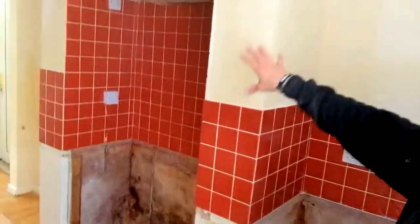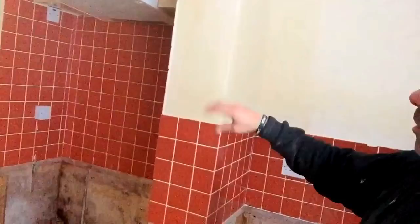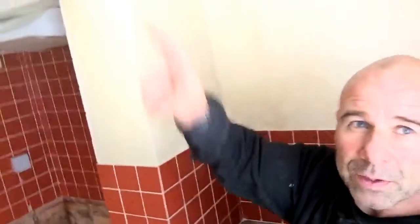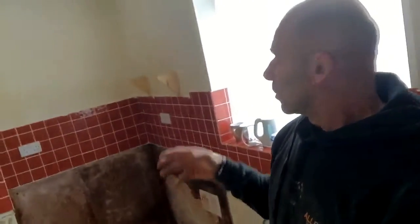Other thing that's going on — a damp issue, a bit of black mould. And then you've got a chimney pier with salt damp. Used to be a chimney. When the inside of the chimney gets wet, the sulfates eventually migrate to the surface and they absorb moisture from the air. And if you look, it's got like a yellow tinge to it. So if you look on a chimney breast and you see those big sweat patches in winter — which is this time of year — nine times out of ten it's going to be the sulfates absorbing moisture from the air. It's condensation season, so most properties are quite humid.